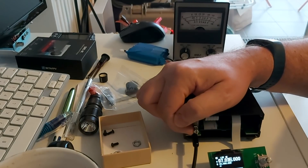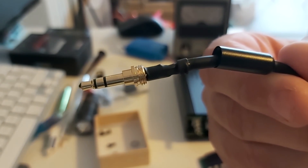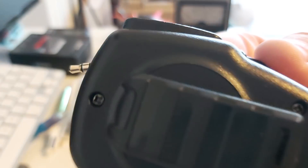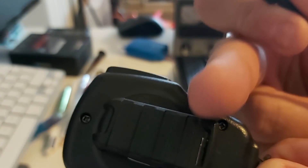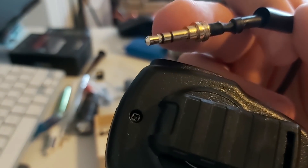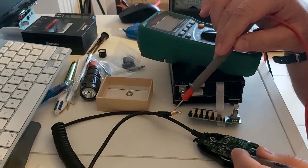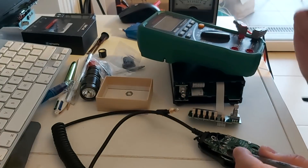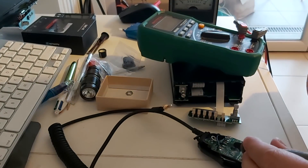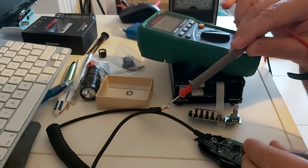You never know — it might not be the jack in the radio. The jack has a heat shrink around the wires so I'm not going to cut that off. I'll open up the microphone and see if the contacts inside are actually electrically connected to the prongs on the jack. We have one contact here — the black wire should be ground. Another black wire. And a white one. We only have three contacts here so not all of them are going to work.